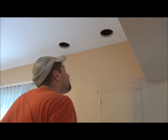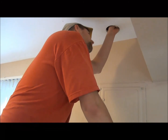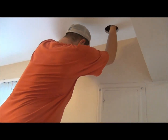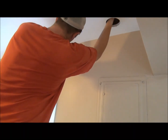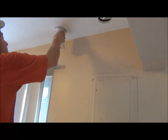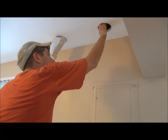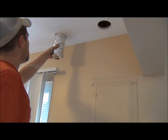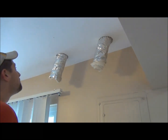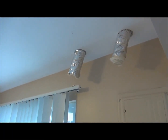We're going to be pulling our two and a half inch supplies through the holes we just cut. Ryan is just reaching in here and we're going to pull this down about a foot or so, just so that we have a little bit of a stub to work with. This is our two and a half inch sound attenuating tubing, and we have them stubbed for when we attach the outlets, which will be our next step.